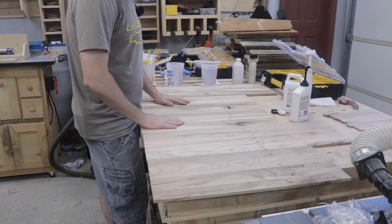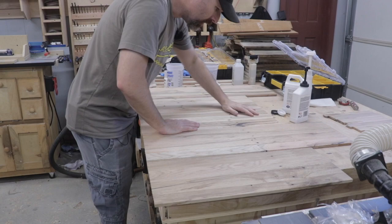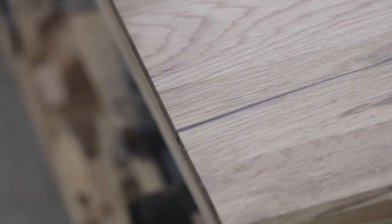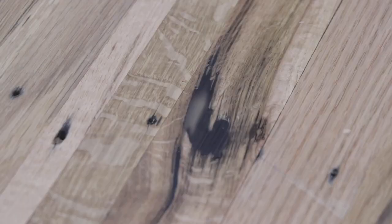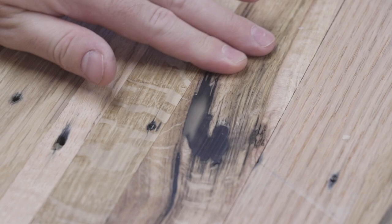I got all the boards milled down to their final thickness, which is three-eighths of an inch. The epoxy worked really well where it was poured into those cracks and defects, and I think it'll definitely strengthen the wood a lot. There was a pretty good-sized check going all the way down this panel and it filled in really nicely — you really can't even see where the epoxy is unless you really get down there and look at it. You can also see here where there was a good-sized defect and that filled in really nicely and planed down just really nice and smooth. You can't even feel the difference with your finger as to where the epoxy is versus where the wood is.